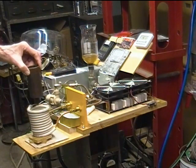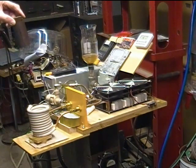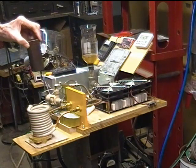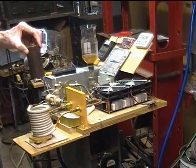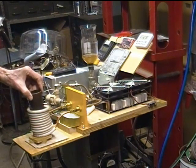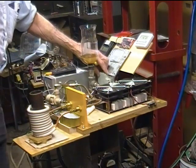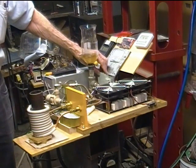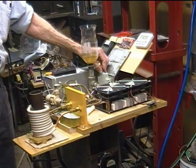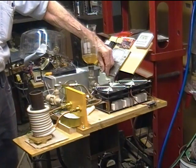Place the water pipe in the work coil. I can't put it all the way down in the coil or it'll draw way too much current. The power supply is on but the DC switch is off. So I place it in there — I've got it sitting up on a block. I will now turn the power on and I will read you quickly the current and the frequency: 50 amperes, 40.2 kilohertz. And nothing broke.